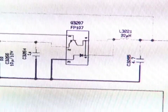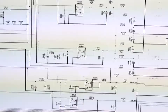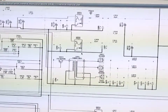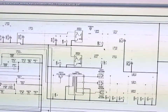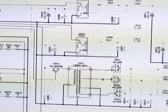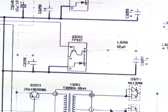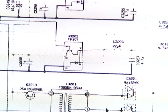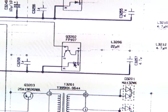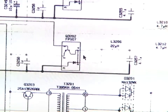Because this transistor gets a bit too hot, one bodge repair we could do is substitute one of the other transistors. Looking at the schematic, there are several more regulators — Q3202 here provides a 5 volt rail. The voltage drop will mean potential for less power, but we don't know how much current that rail draws. So what we could do is transfer the surface mount transistor into the 3 volt rail and put our bodge transistor on the 5 volt rail and try that.